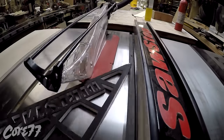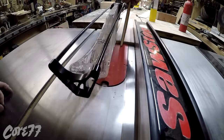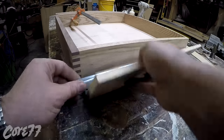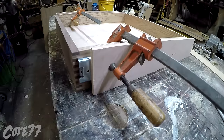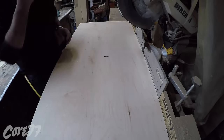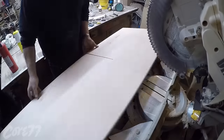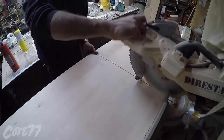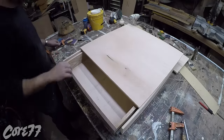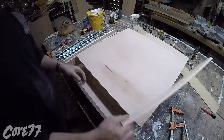This lathe table was made by somebody years and years ago — wasn't me — and there's angle iron underneath it. So I need to put the drawer inside its own box. You can see the sides of what's going to become the box that the drawer will hang inside of, along with my full-extension rail slides — the drawer is going to pull completely out. Since everything's going to be heavy, I have to make sure everything can withstand the accumulated weight of all those metal parts. Here you see me nailing the top to those sides: I glue them, then air-nail them, then screw them — it makes the workflow a little easier.